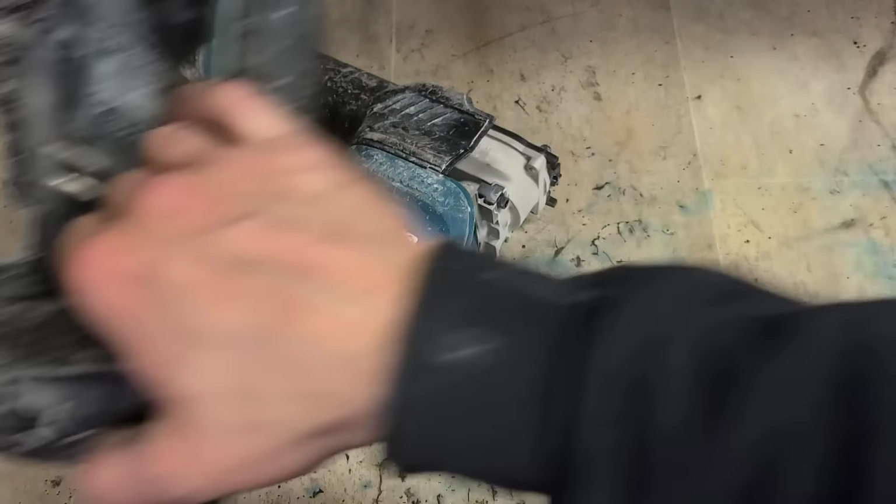It's a wee bit dry actually. I'll just crack it open as well and see what it's like. You should be able to hear that striker going back and forth. Sometimes that can indicate a dry chamber. Yeah, so you really should be hearing a wee bit of compression back here. Hearing nothing. So more than likely, these O-rings in here are worn as well, which would make sense. Well, it's done that much work. So we'll just replace them too.